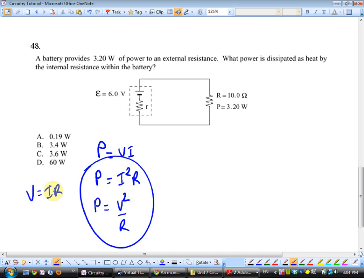Okay. How do I solve any circuit? Try and find the total current. Did they tell me the total current? No. My next step is I go find any resistor where they told me two things, because if I know two, I know four. Wait a minute, I thought it was three. Well, no, we said also now if I know power, there's four things: resistance, voltage, current, and power. I'm going to start here. So let's see what I can figure out.